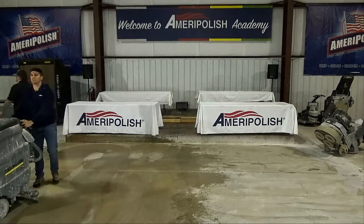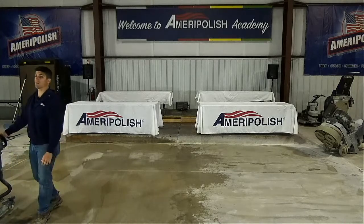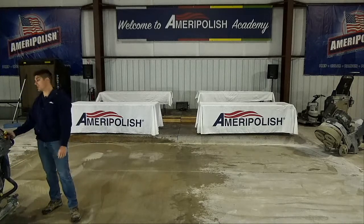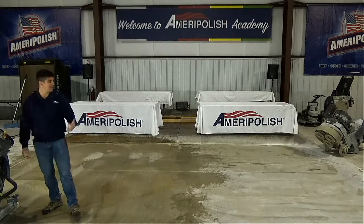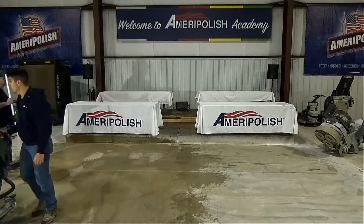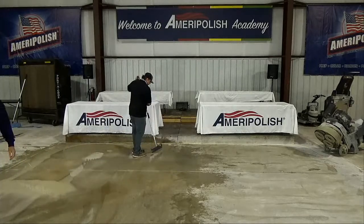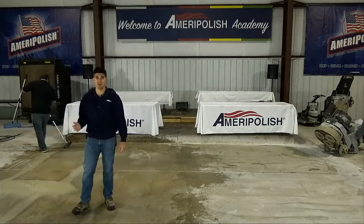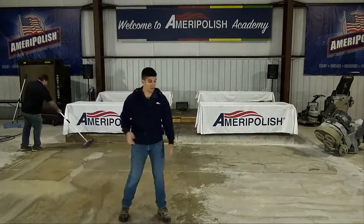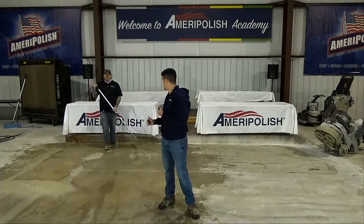Kamar, MDC, San Antonio, thanks for being on. Is an RPM required by steps on the machines? We don't have an RPM requirement. On the Lavina 20 that we are running here, we noticed that it runs better as wide open as the machine can go, so the highest RPM it's capable of. However, on the HTC, I think it's a 6 or 7 that we found works.